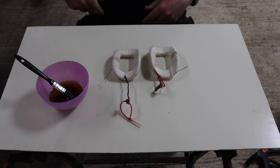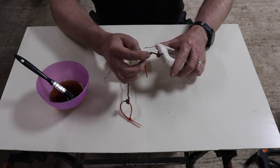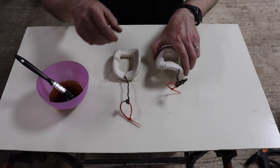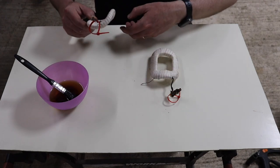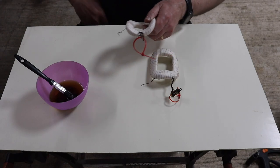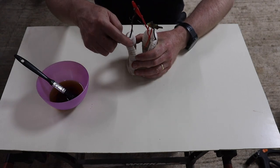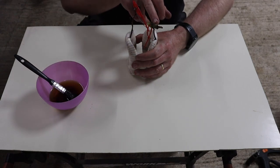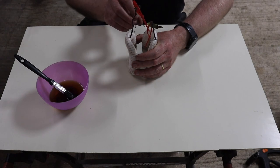Okay, I've checked it, and that is absolutely correct. So this one, obviously, is essentially the field coil terminal, that sticks up through the back of the generator, dynamo. And then this one rivets onto the body of the dynamo. But those two points are quite close to each other. So this one actually has to go round to a point over here. That's why this one is sticking out longer. That one is right next to the place where it needs to get riveted on. And then these two just get joined together, and you've got an insulator for those.